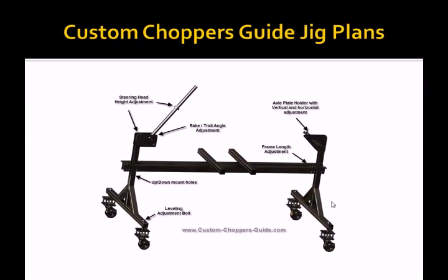There are also partial jigs used for fabricating bits and pieces like the wishbone and down tube before bringing them together with the rest of the frame. Types of jigs include basic flat plate, modified flat plate, parallel beams jig, compact plate jig, bottom-up jig, and external jig, to name but a few. The first thing all jigs need is a solid base that is true and perfectly level — this can be metal girders stacked on blocks or set on a perfectly level workbench.